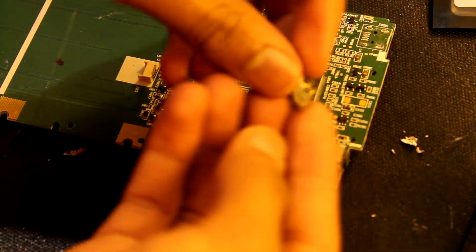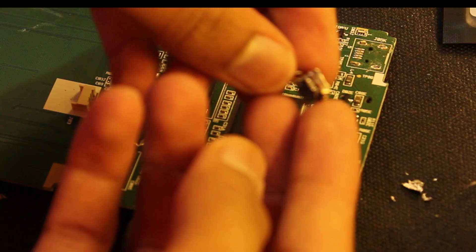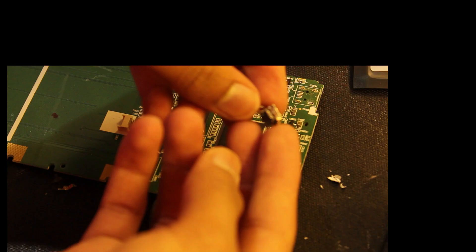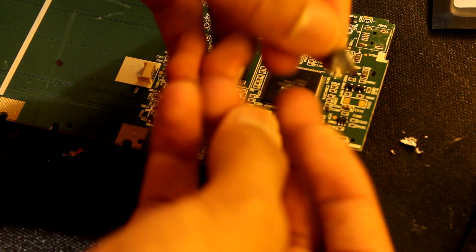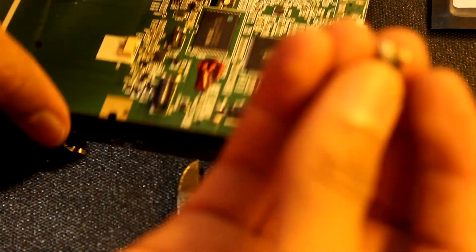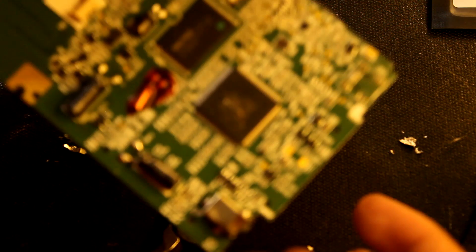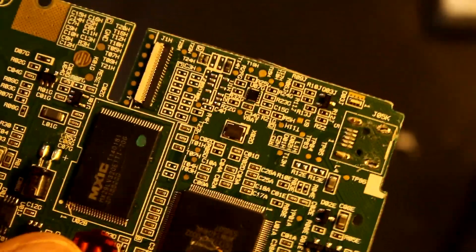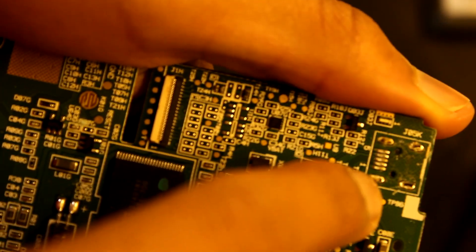Alright, so I just took off this micro USB. I mangled the absolute shit out of it. I don't have the right tools for this, but hey, no one has the right tools for this. I just ripped it off the solder pads. I soldered these four spots over there to research the pin for this micro USB. There's five pins and then one there, so I'm guessing it's VCC, data plus, data minus, and ground. I'll have to find out wires for those.